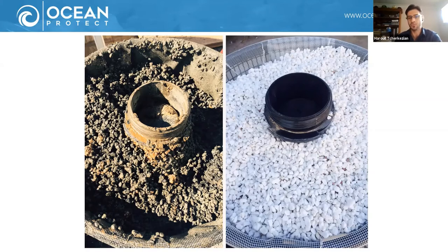We'd be draining in through the bottom the entire time, or as water comes up to whatever level that water level is relative to the cartridge, that's the only media depth you'd use. In this case with StormFilter, we utilize the entire cartridge because we engage a siphon. And that photo shows it. Up to the top, under the hood, at the cap, the entire media bed has been exhausted and has been filtering water. So even if the water level drops in the system, we have a hanging water column in the filter that allows us to continually use the entire depth.